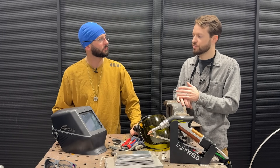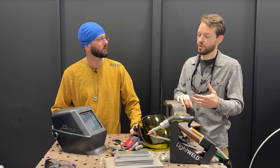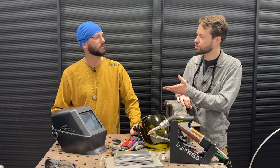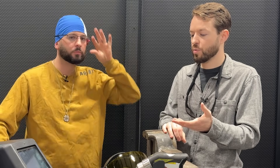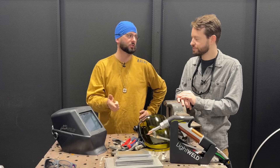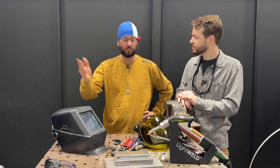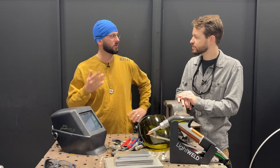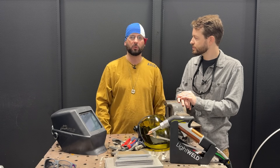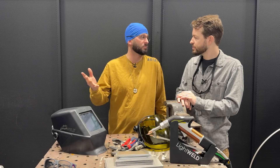Recently though I've seen a few things where people have actually been defocusing the beam on the surface and using stainless wires. So you retain your corrosion resistance - by defocusing the beam we don't vaporize the galvanized, and by using laser properly we can actually get good penetration. We're going to do some destructive testing - some T-joints, fillet weld breaks, lap joints, and cross-sectional etching to see what we've got as far as quality welds and brazes.